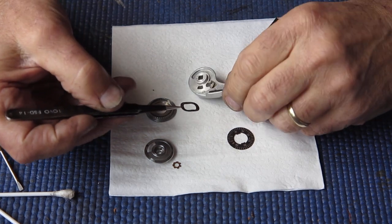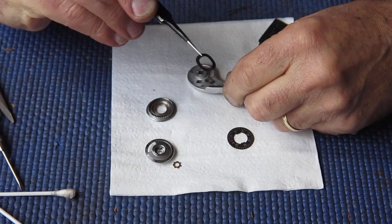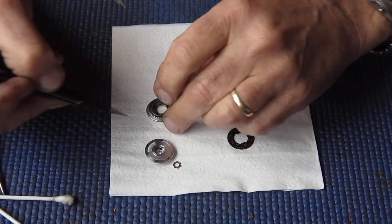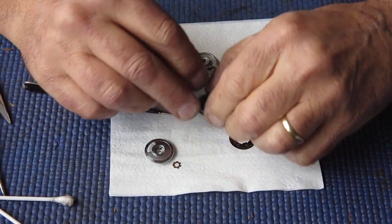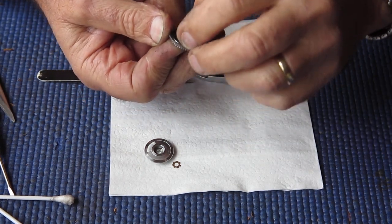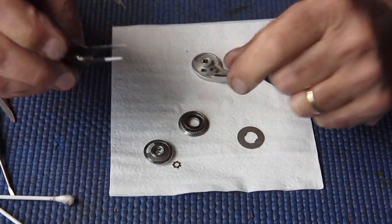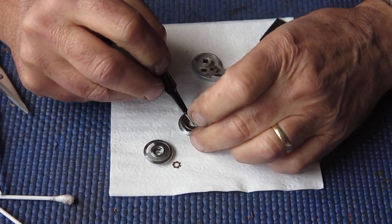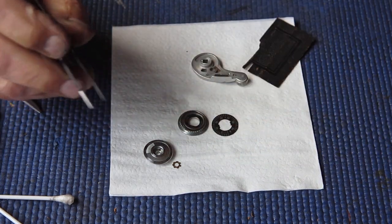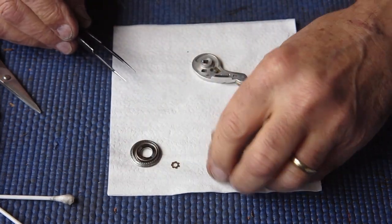As I went to reassemble this lever, I just replaced the rubber pad here because that was shot. I noticed that this spring washer was missing. Normally that sits in there. That would apply some upward pressure, which would help keep all these components correctly engaged. And I suspect because that was missing, probably as a result of a previous repair, that's how this disc came to be 180 degrees out from where it should be. So I've pretty much got a full set of parts there to go.